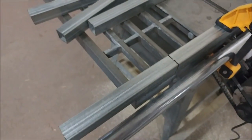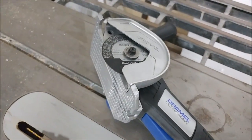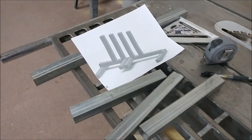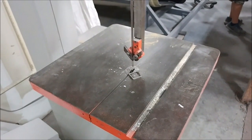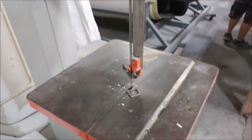Welcome back. First half of this week, a bunch of different things going on. The first thing I wanted to create was this fixture which would work on our bandsaw table, so I can hold the exhaust pipe and intake pipe and cut it correctly across the bends we're going to get in there, because we're going to get radius bends and they need to be cut correctly.